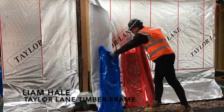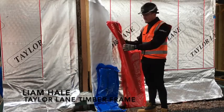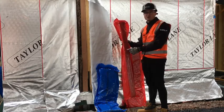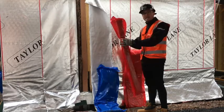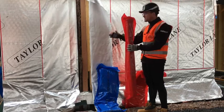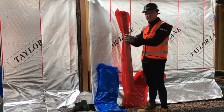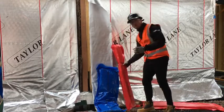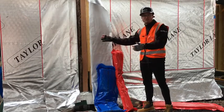The first product is not a standard fire sock — we sent this with a kit. This is a 200mm long standard 90x75mm fire sock, 75mm that way, which basically sits between the end of the external walls. You insulate your cavity as standard with a party wall insulation and this fire sock is then fitted into the end of that cavity. On top of that, you put the paper lap over the top, and the standard lap on the panel is 300mm wide to give a 150mm lap.